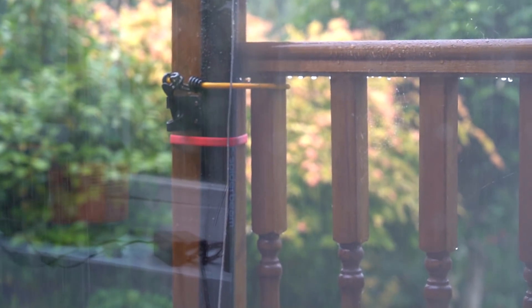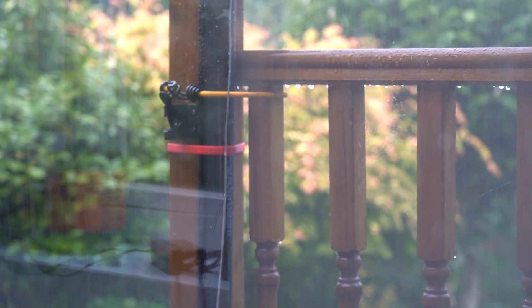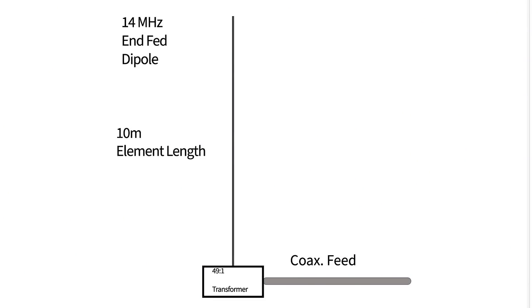As you can see it's just whacking down with rain at the moment. The first antenna I used when preparing this video is an end-fed vertical half-wave for 20 metres. That vertical is 10 metres long, and it's fed at the base with a 49-to-1 matching transformer. The antenna will also work on 10 metres because the harmonic of 20 metres is 10 metres, so you get a dual band antenna.